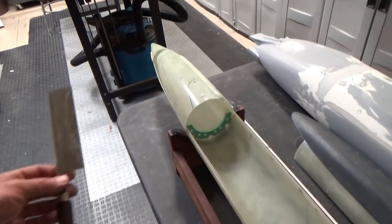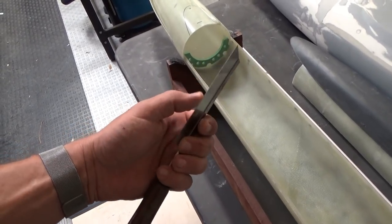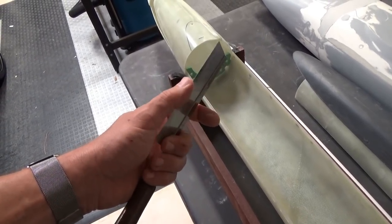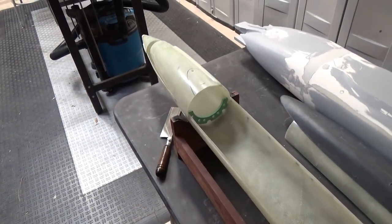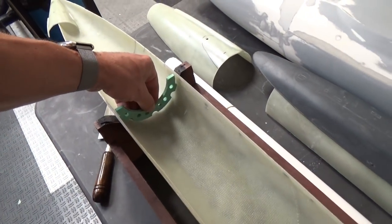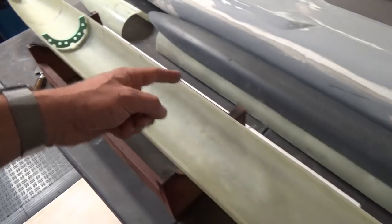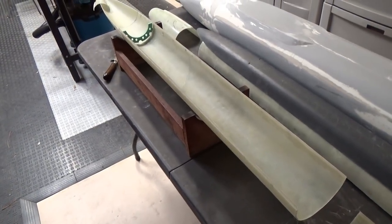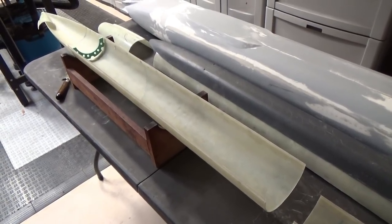A quick note about the tools I used: I used a razor saw to make those cuts. It only removes about a 64th of an inch of material per cut, so you don't lose much material or overall length that you'd have to backfill later. I've also mocked up the supplied bulkheads — these are set up for a three-and-a-half-inch diameter watertight cylinder and will maintain proper spacing throughout the hull. I have a three-and-a-half-inch OTW dive module on the way with a custom 14-inch ballast tank.